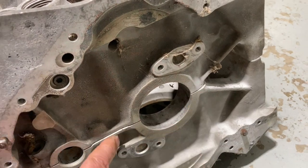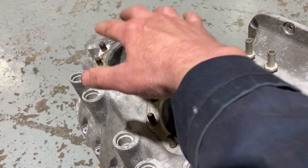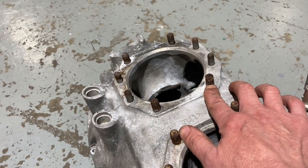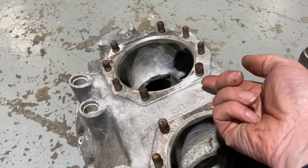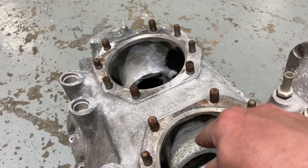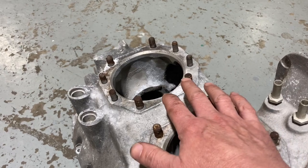That doesn't always happen. There are a couple of gotchas on a Lycoming. If they've had cylinder work mid-life and the procedure for torquing down the cylinders hasn't been followed religiously, things can go wrong. These through studs are an interference fit — if you release the torque, the nut on the other side can pull the stud a few thou back. When you re-torque this cylinder, you must re-torque the other side simultaneously, otherwise you can have a stud that shifted slightly and didn't pull back through, so the main bearing can come loose.